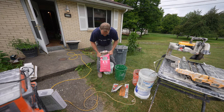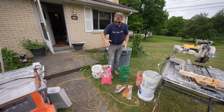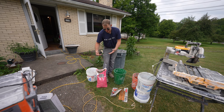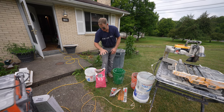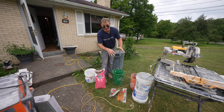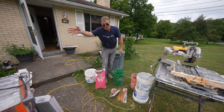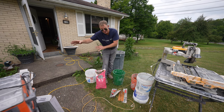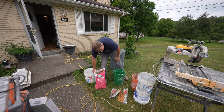When it comes to thinset, this is really where I think you should spend a little bit of extra money and get a good quality thinset — it's going to make tile setting so much easier. Something like Ardex X5 is a non-sag modified thinset, so it makes it easier when you're setting tile because they don't move as much. What's really great is you have plenty of pot life — at least three hours after you mix it. That's really helpful for beginners because you need more time to cut things, especially when using a wet saw. Spend the extra money on the thinset; it's going to make it a lot easier. Always measure your water too.